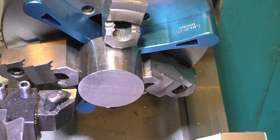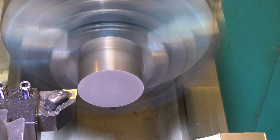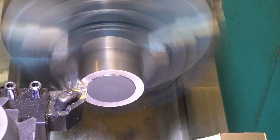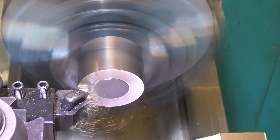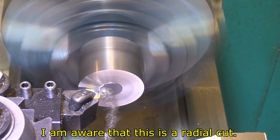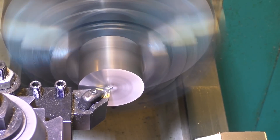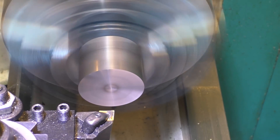Let's see how this stuff faces — I'm curious because I think it's going to be pretty hard. One way to tell is if you get a really nice surface finish without taking a massive feed rate. This is 7 thousandths per revolution. With my experience with 4140, especially longitudinally, you get a lousy surface finish unless you take a really big bite — or it's pre-hardened, then you get a great surface finish. Must be the grain structure. This wasn't terrible. Let's chamfer this and flip it over.